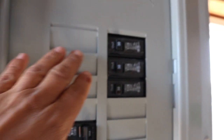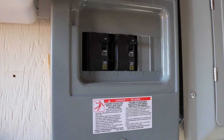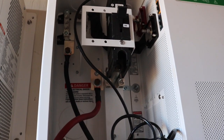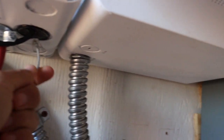First, I'm going to shut off the power flow. Over here are the breakers for the RVs — I'm just going to shut these off, the two breakers going to the main panel, and then shut off the DC power going to the batteries. Now that there shouldn't be a draw, I'm going to hook up the wire and run it down to the batteries.